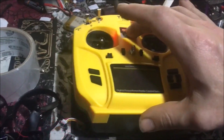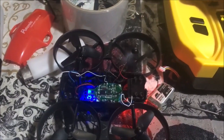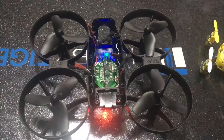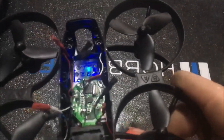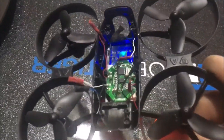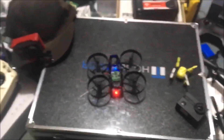I got one motor wired up, so we're going to turn on the Jumper here — and the flight controller went solid. So that's working. We're going to get the other motors wired up. All the motors are wired up. What I've done is put a little bit of heat shrink on each of them — positive and negatives — and I like to press them after heating. It hurts my fingers a little bit, but it makes sure the wires are definitely not going to come apart. We have this bound.